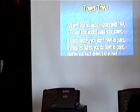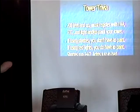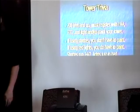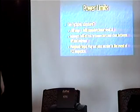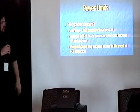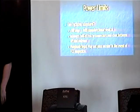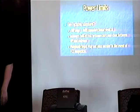Tower trivia: 200 feet and up, you have to register and paint your tower. If you use strobes you don't have to paint, but they run 24/7. If you use red lights, you do have to paint. And you still have to worry about people complaining about birds that fly around your tower and wound up killing themselves somehow. Towers are extremely expensive. The golden standard when I got into this stuff was a half-watt amp plus an 8 dBi Omni vertical, assuming about 1 dB of loss in the coax and connectors. The figure may be a little higher or lower — you just hope an FCC agent doesn't show up and want to find out for sure.